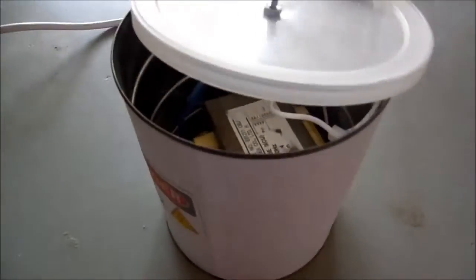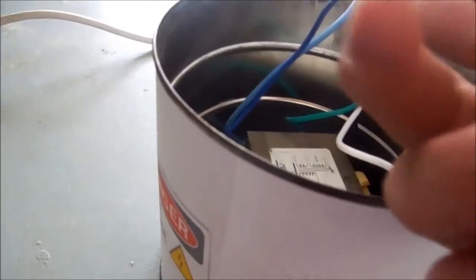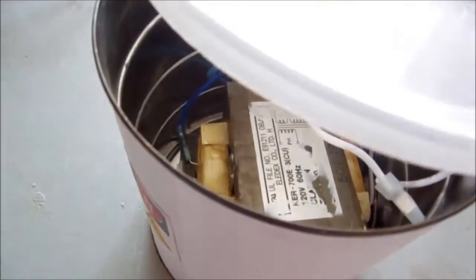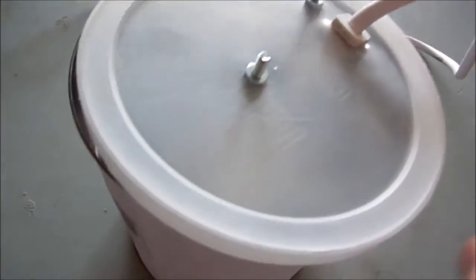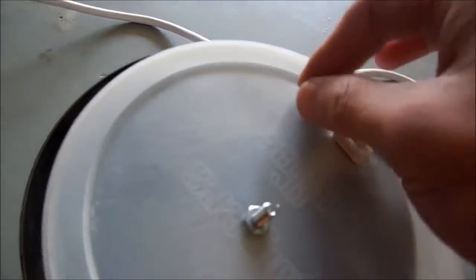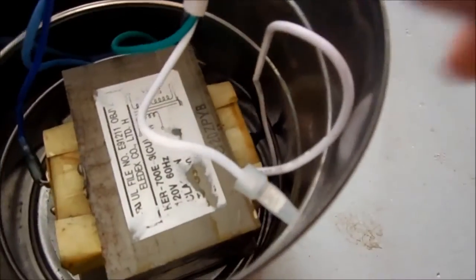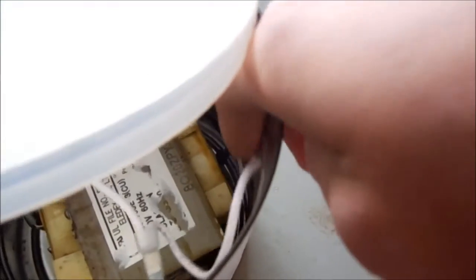Move the camera down here so you can get a closer look. This bolt right here goes to the hot wire coming off of it. Then this is the mains wire. And here is your grounded hole — it's connected to the case of the transformer along with the ground coming from the mains cable. The mains cable just attaches in right down there: neutral, this white one, and then the black one — live wire.